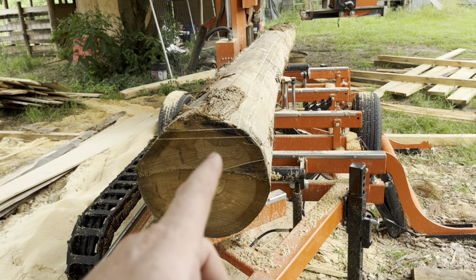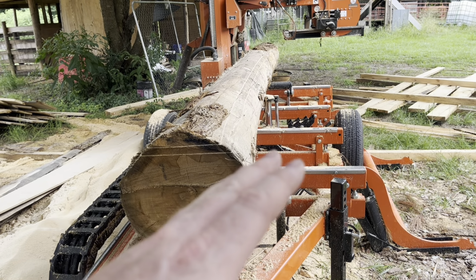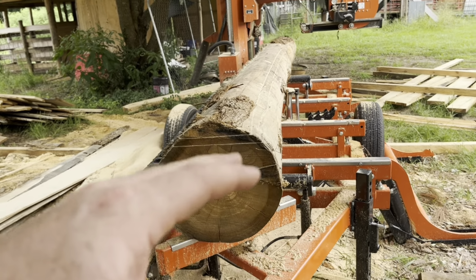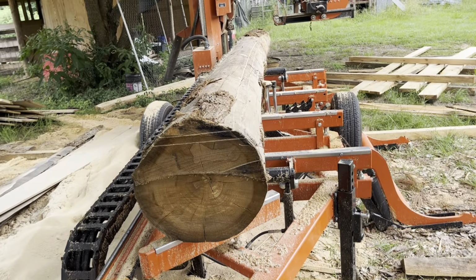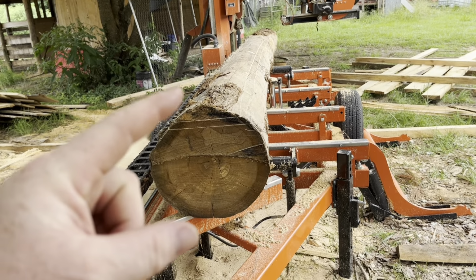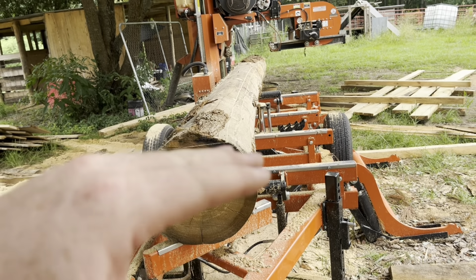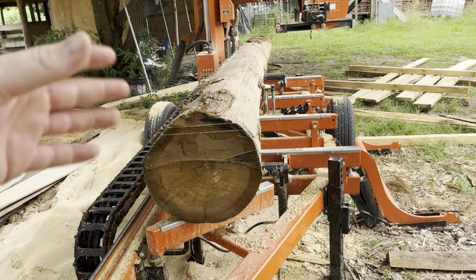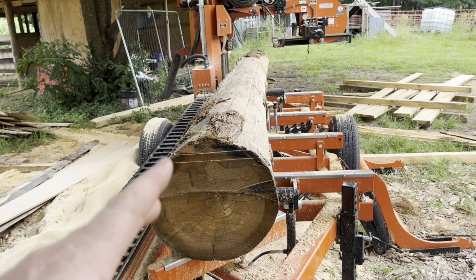Say I'm cutting 8x8 right here. I will not hardly cut below 10 inches or 9 3/4, because I'll use pattern mode and it'll cut to 9 3/4 and all that. So it's just easier to keep everything square and even, 1 inches and all that. But I'll do that, flip it, and I try to save that last inch, and then I'll have a 1/2 inch cut. And if I need it, like whenever I turn it right here, this is on small logs. Now, if I had a great big log, I would slice it down more than 2. But I'm talking about close stuff.